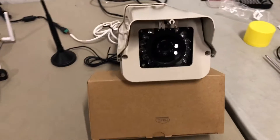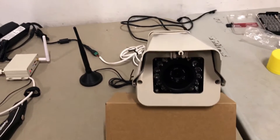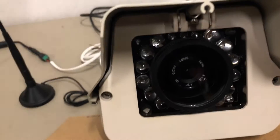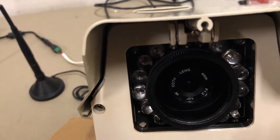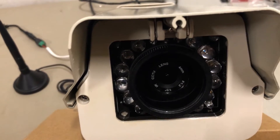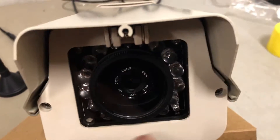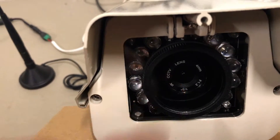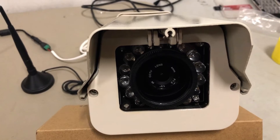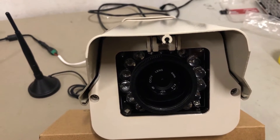Here's a video to show you how this 5858 wireless camera works, specifically its nighttime viewing. In front of the camera there's a photo sensor that switches the infrared LEDs on and off based on whether it senses light or not. If this gets broken, it'll stay always on. The camera works independently and has software built in that senses whether it's day or night.